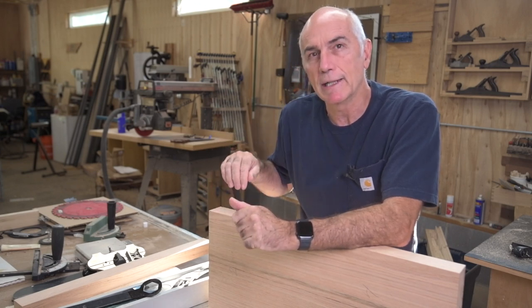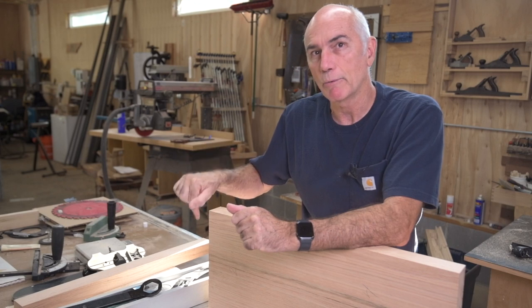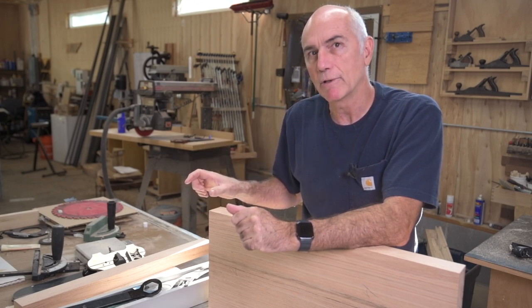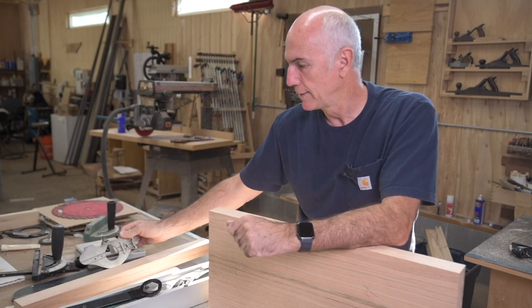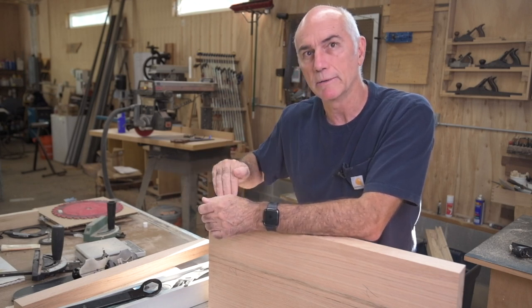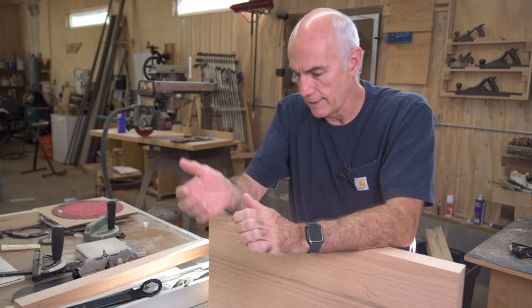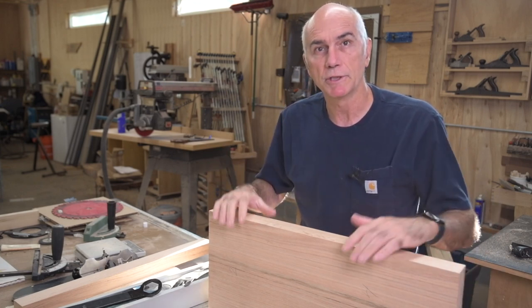I'm here at my table saw with a dado stack in there, but I was just thinking I may have made this harder than I needed to. I probably should have left these pieces a little bit longer, cut a rabbet or rebate in them, and that way I'd have a shoulder on the far end of the tenon to rest a router plane on — you'd have had two surfaces to register the tool on rather than just one. That might have been easier, but that ship has sailed. So I'm still going to try using the router plane and a variety of stuff. I'm in new territory here, but I will just creep up on the lines and finish it off with chisels and planes.